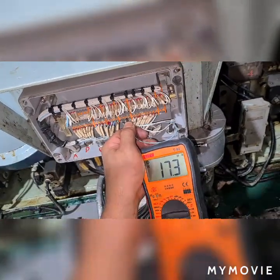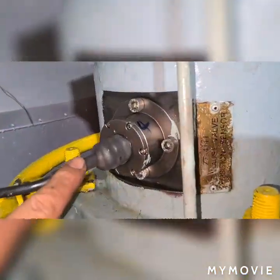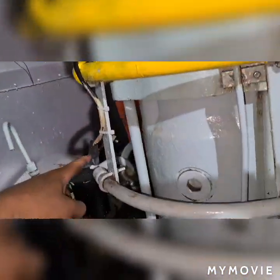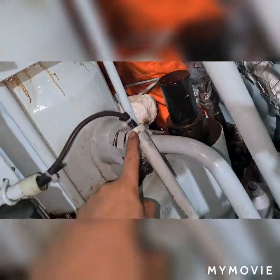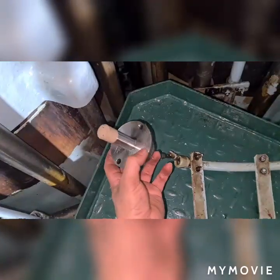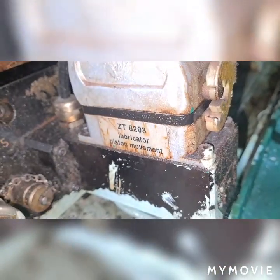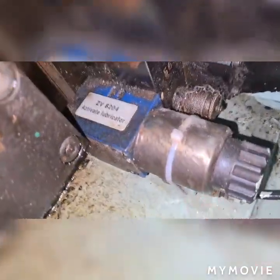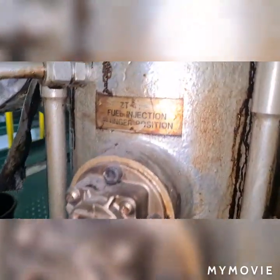Further knowledge, you can also check and test how much is the 4 to 20 milliampere value on your sensor by connecting your multimeter in series with terminal 3 and 4. What you can see here is I put insulation on each edge, so we will be able to avoid this happening, which causes electrical noise, which really affects the RPM or the speed of your main engine.